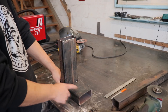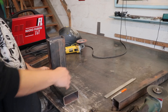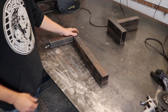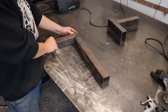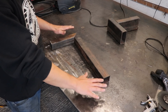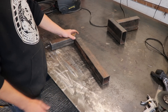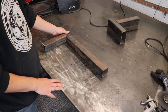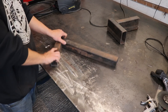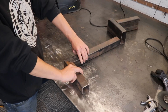If you were to go around and do the same thing on a load of legs without realising, then you go around and weld something up, and you come back to it and realise that nothing's actually at a right angle. Say you're building a table or something and you're trying to keep the top of it flat — you want it to be a flat level piece when it's done and welded together, and you've got no way of fixturing it down. If you imagine what a shrinking weld is going to do, the last place you want to be welding first is on the top edge, because as that shrinks it's going to be twisting it.